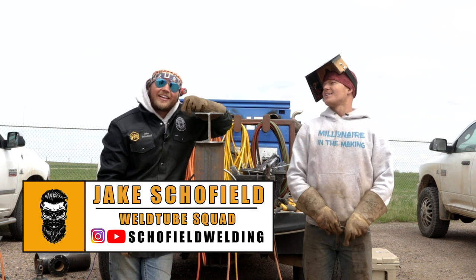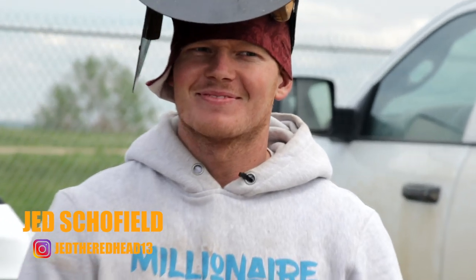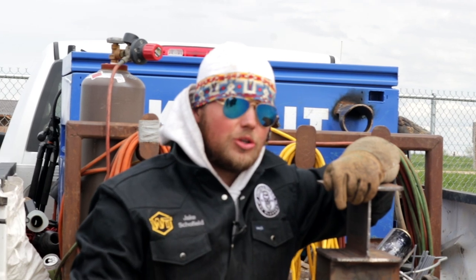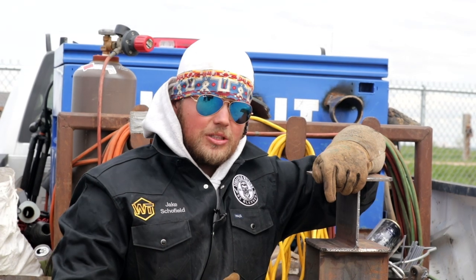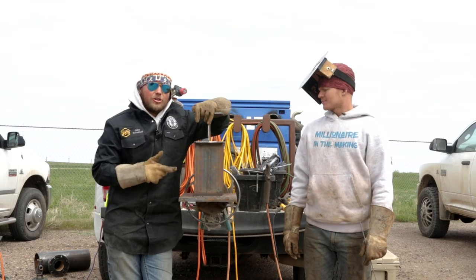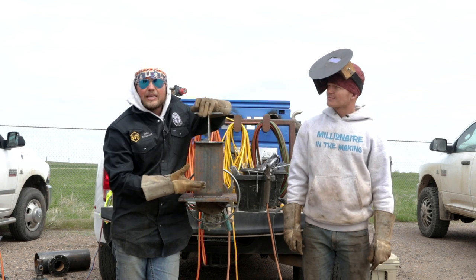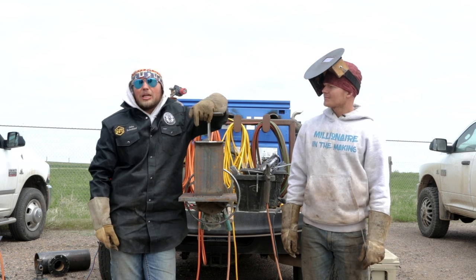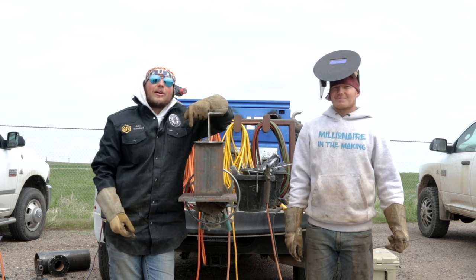Schofield Welding. This is kind of exciting — I'm super excited about this. This is my brother Jed, Jed Schofield. He is a contract welder, a rig welder that is the structural hand slash pipe welder for the company that we work for. He takes care of most of the support systems, anything that needs supported, Jed takes care of it. In this episode, he's going to show you guys different things that he does to put in 7018 fillet welds. He goes in with some 6010, 5P plus for big gaps and things like that. I'm going to let Jed go ahead and take over and we hope you guys enjoy.